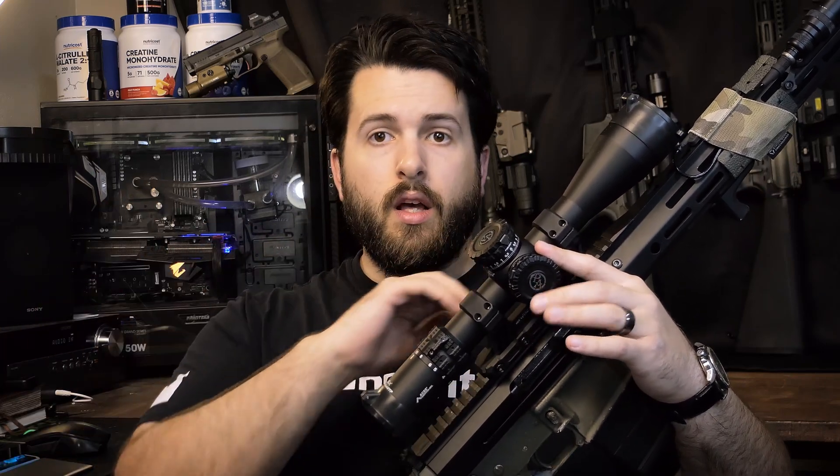So, that is the remedy on this specific upper. It should be noted that the gas block that upon first inspection looked absolutely foolproof — dimpled barrel, six set screws, pinned gas block, should never move — however, none of the set screws were torqued down properly and the pin was not pinned properly, so all of those things are basically rendered moot. That is the update to the GPX. We're still going to do a full 1,000 or 2,000 round review, whatever it ends up being. This is just a quick addendum so you guys are aware of the issues, so it's not seemingly positive for three or four months and then a negative review comes out after some of you bought it without realizing there was an issue. Thank you so much for watching — I'll see you in the next one.